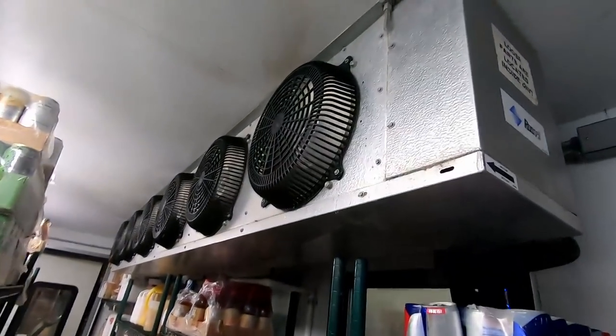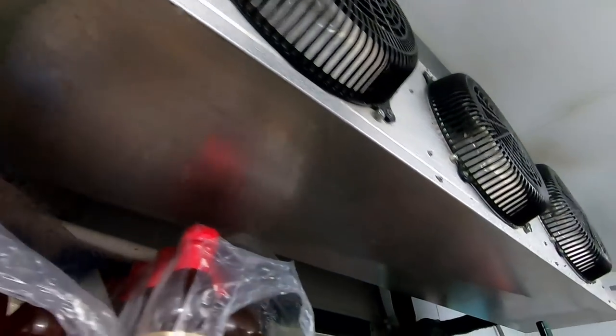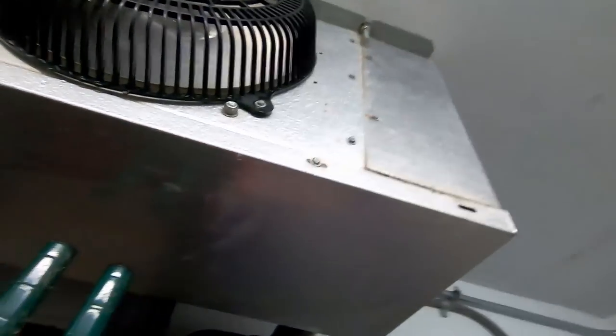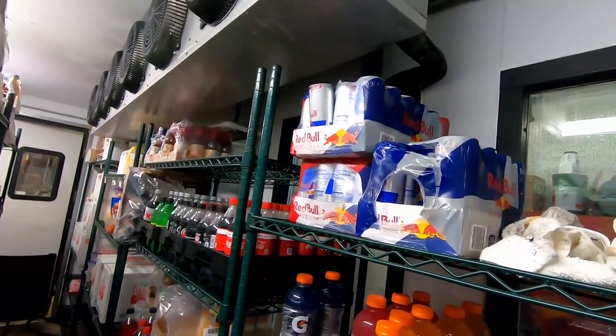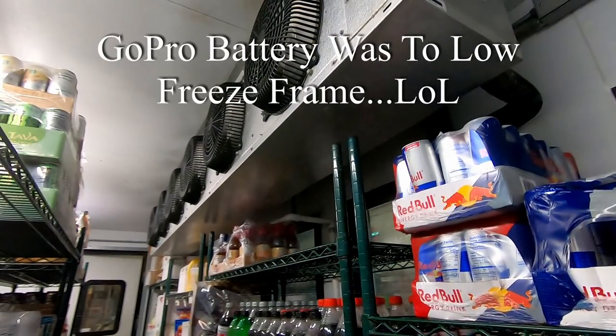All right, so they're all running — that's always a good thing. These look like they have the electronic control motors in them — you can just tell they're a little bit different. We've got the coils cleaned on the back, got a lot of crud out of the drain, and everything looks a lot better. I'm going to double-check that clock — I have a feeling we just need to change it. The defrosts are definitely going to be longer than the 40 minutes they had. Taking it up to 55 minutes, four times per period. You've got it here with the beer cooler which runs a lot colder.